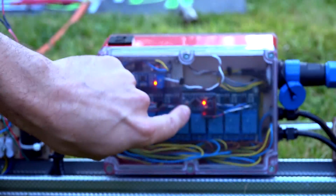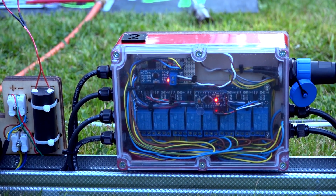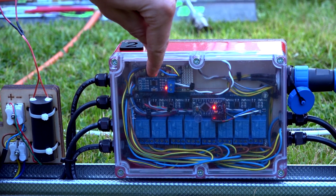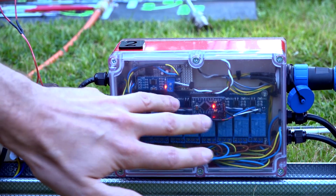In one of these little control boxes you can see an Arduino Pro Mini. It's connected to this solenoid control board — that's the RS-485 level converter. The Arduino just turns on and off these solenoids which in turn make sparks happen and gas come out.